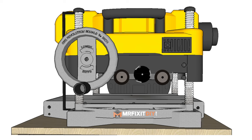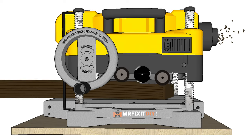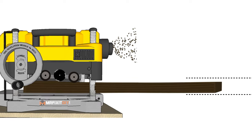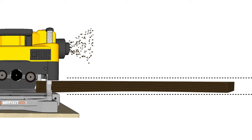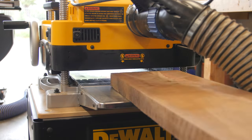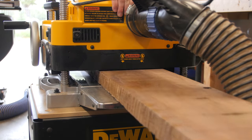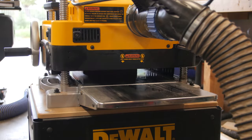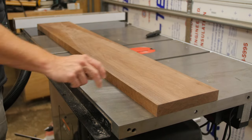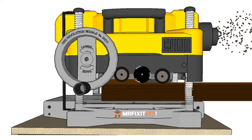If you flip the piece over and feed it through the machine, the rollers will push down on the bow and flatten it out as it goes through. As it comes out the other side, the board will spring back to its original shape. So while your board will be uniform thickness, it still won't be flat. The same can mostly be said for a board with a twist in it. As the board is fed through the machine, while it may take a little bit of the twist out, the rollers will push down on the board and it will follow whatever the opposite face of the board is doing. As it comes out the other side, the board will be a uniform thickness, but it won't be flat. The one scenario where a planer can produce a flat surface is if the piece has a cup in it.